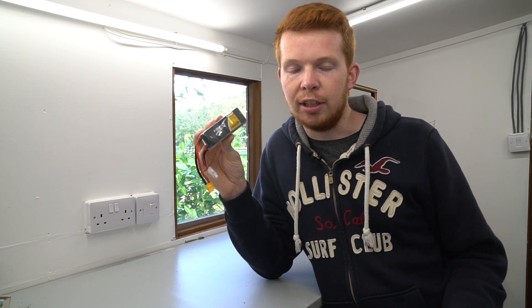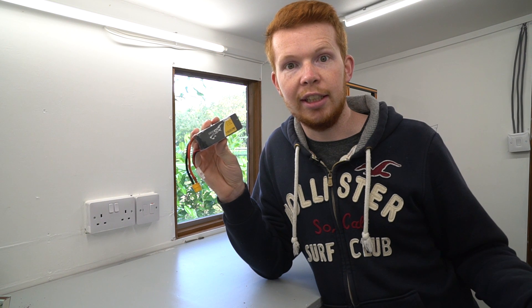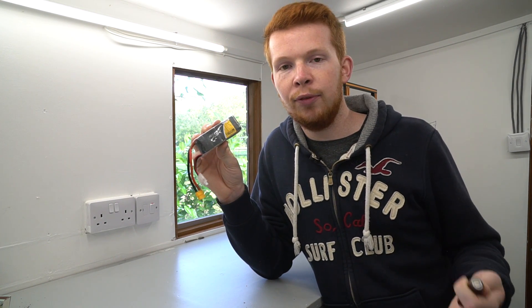There are lots of ways to increase the flight time of your aircraft, which include gaining altitude and gliding, slope soaring, or finding thermals to create more lift. However in this video I'm only going to take into consideration powered flight, so the motor would have to draw 1.44 amps constantly for an hour. Now 1.44 amps is quite a low amp draw for an aircraft that would carry a battery like this, so getting one hour flight time might be quite difficult.